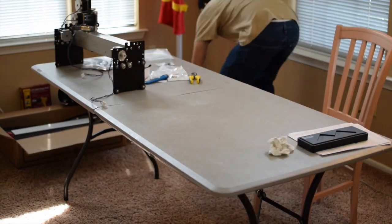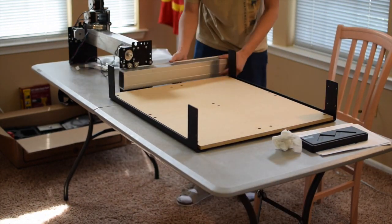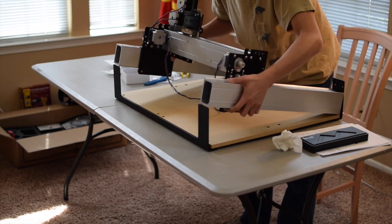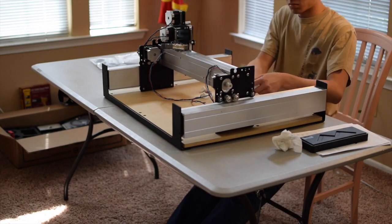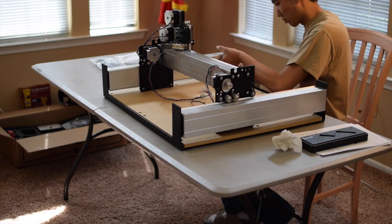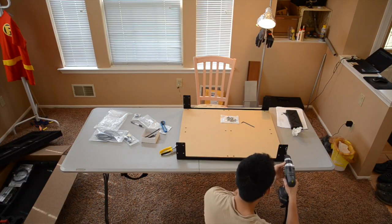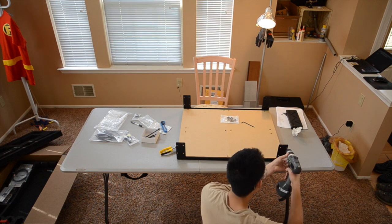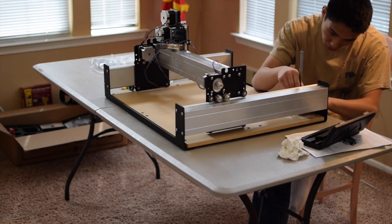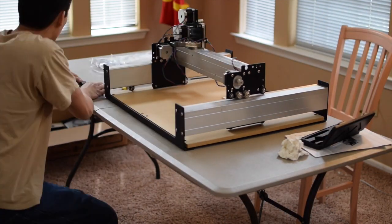Slide your two remaining rails through your Y-axis plate V-wheels and get ready for step 6. For the last major step, you'll be attaching your Y-axis rails to the base frame. I'd recommend folding up a couple layers of cardboard as shims to support your rails at the correct height while you bolt through the front and back end plates. As with the eccentric nuts, you may want to drill or grind out the powder-coated holes if you find interference. When everything's in place, you can go around making sure that your rails and plates are squared up and tightened down on all your screws. Don't forget to adjust your eccentric nuts and V-wheels either.